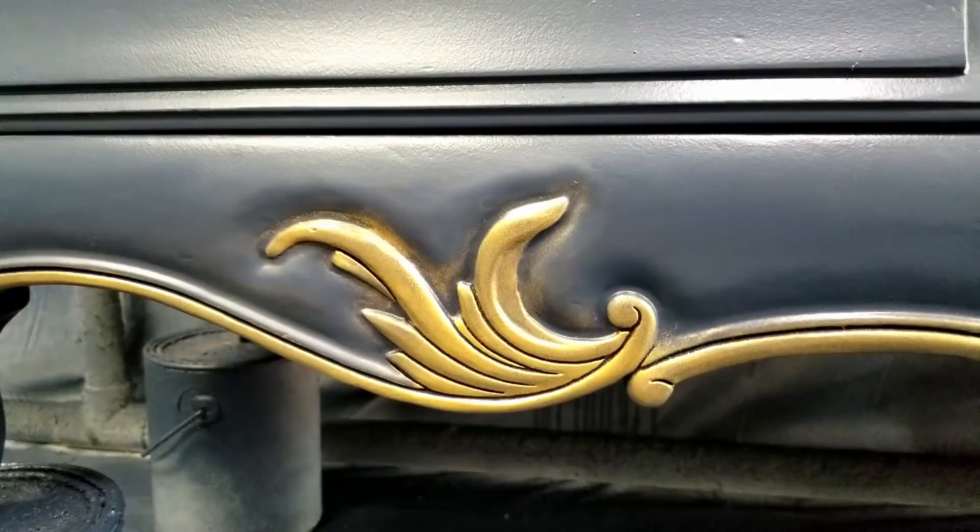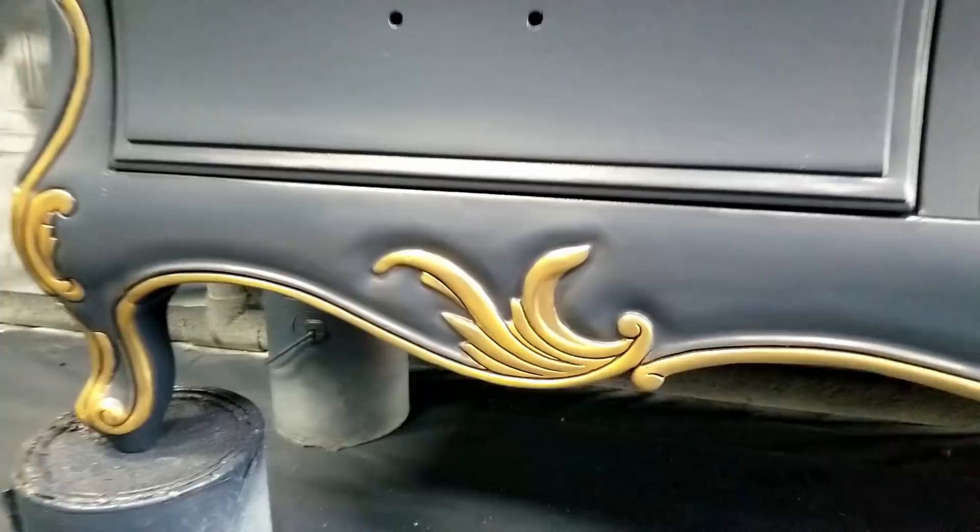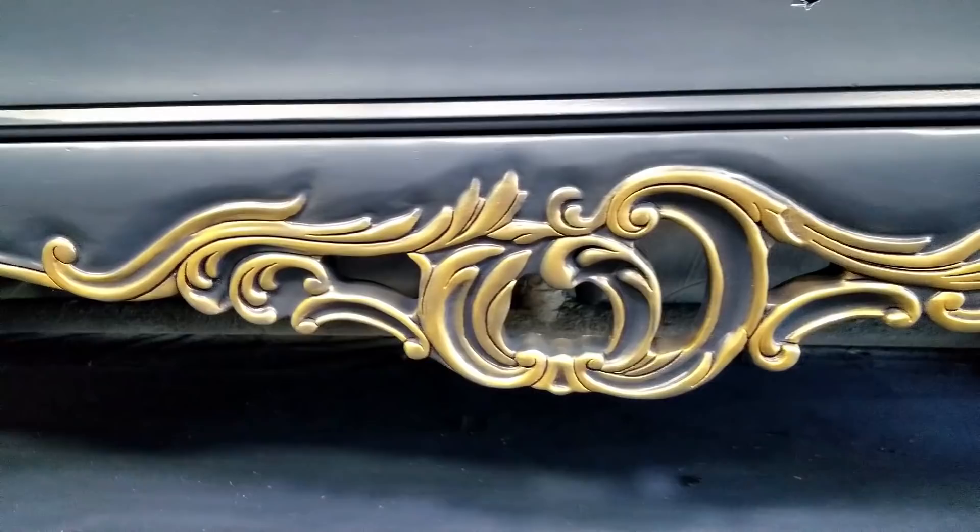You can see here where it got real sloppy after I applied it with the sponge, but I came back and cleaned it up and these lines came out looking super bold and super clean. I found that you can use water to clean this wax up, but it's a lot easier and faster to use mineral spirits or paint thinner.